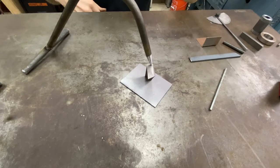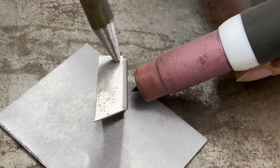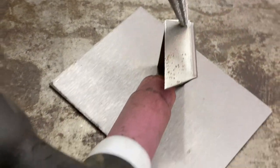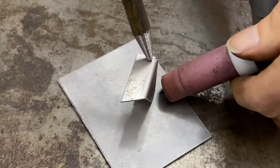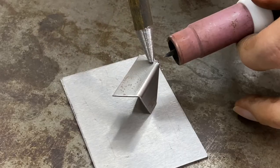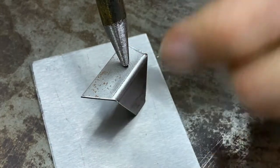So now we have a part set up that's cantilevered. You know, as an example, you could get right up here and do your seams and even get on the inside if you orient the finger the right way. One benefit of this is it allows you to get to really small parts or really close to the clamp if you need to. I could go right along and seam this gap up here at the top and not touch the third hand or the finger here.